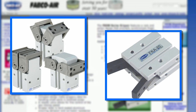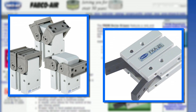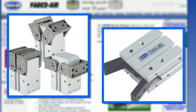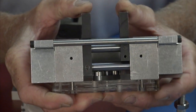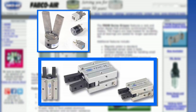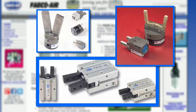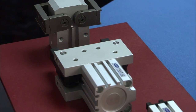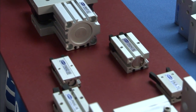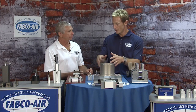Why do we want an angular gripper versus a parallel? Angular grippers, in order to get around a big part, take more swing. A parallel gripper can grip with very low motion. So it's up to you whether you want an angular gripper that starts at 10mm and goes up to 2.5 bore, if you want a round or square body, high closing force, or a fail safe — we have all of that. There are a ton of different options just within the two different styles.